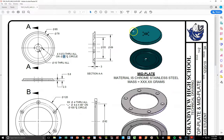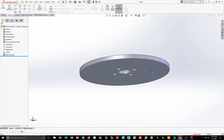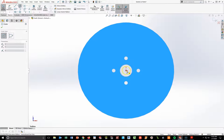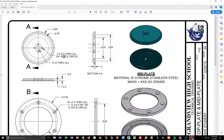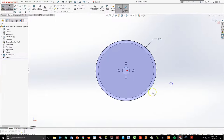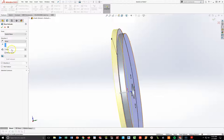That gives me basically the top piece. Now I'm going to hit the bottom of this and create the large outside circle that I will extrude 2.3mm, and then we'll come back and do the recess cut — two more steps. I'll flip this over with my middle mouse button, hit the bottom face, start a sketch, spacebar normal to view, draw a circle, and dimension it to a diameter of 85. Then extrude — making sure the extrusion goes away from this piece — at 2.3mm, as shown on the drawing. Check mark.